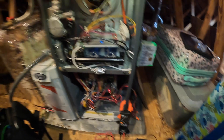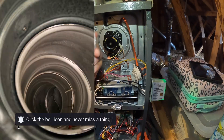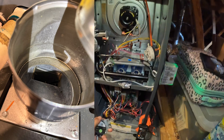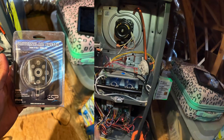So it turns out it's just a bad switch. There wasn't really much debris back here, nothing in the obstructions in the flue pipe, nothing — spotless. I'll show the pictures here in a second, but I'm gonna mount this up and then head to the next call.